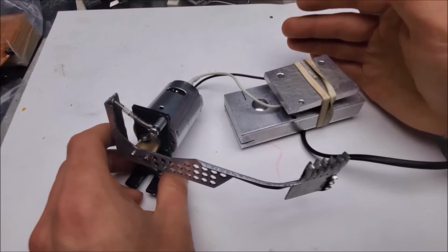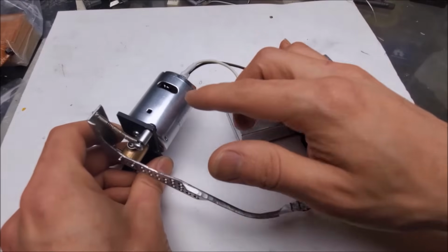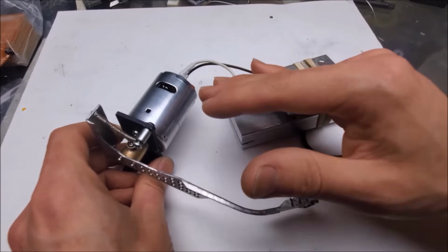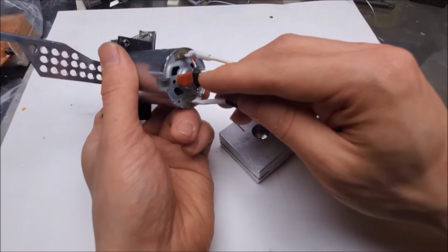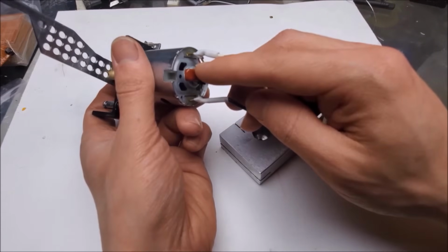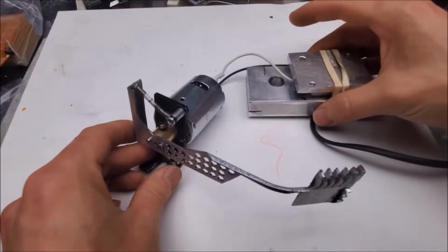I would use a little DC to DC converter, a little buck converter to step down the voltage, but it's a very noisy load when you're switching it on and off, so I don't want that failing. Resistors are harder to kill than a DC to DC converter. I've got a diode here that's in reverse, which is my flyback clamping voltage diode. Little capacitor here to snub out some of the back feed noise as well.